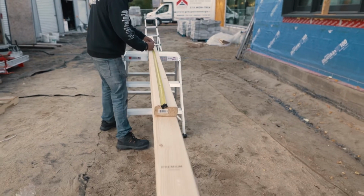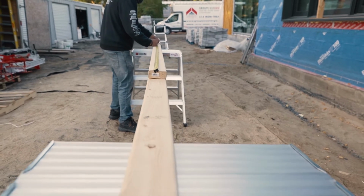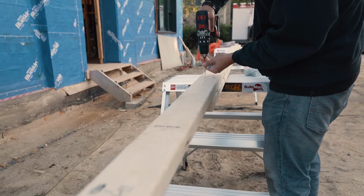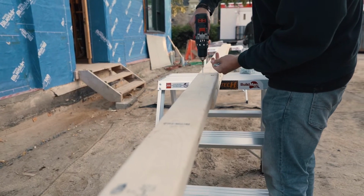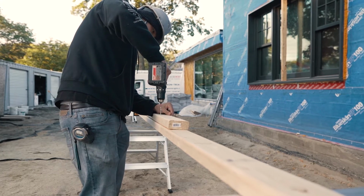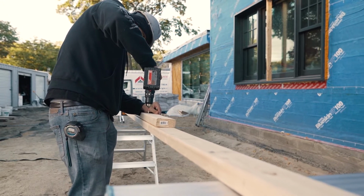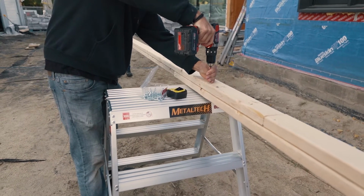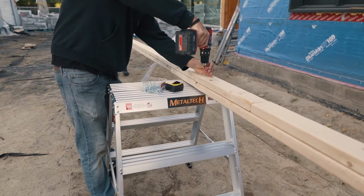The wooden poles should be built of clear, straight-grained fir lumber, free from knots and defects. The poles consist of two 2x4s screwed together to create a 3 by 3.5 inch pole. Number 10 screws are recommended to assemble your poles. All screws should be placed 12 inches center to center, staggered uniformly from opposite outside edges.